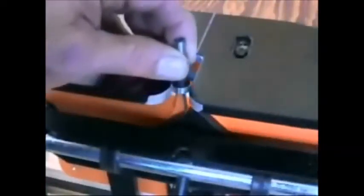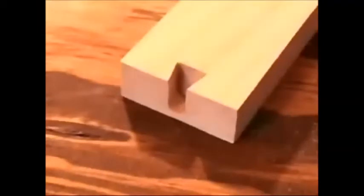At the heart of the N-Lock Jig is a pattern-style dovetail bit. The bearing on the bit rides in and out of the dovetail socket guide in the N-Lock table, making it very easy for you to cut perfect dovetail sockets every time. The dovetail socket is dimensioned to receive the dovetail keys.